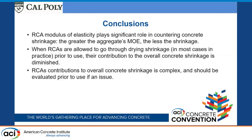Okay. My question is something I'm thinking. People think about recycled concrete aggregates. Sometimes they're porous. Saturated aggregates may be used as an internal curing agent. So that looks like controversial to the testing result you have. So I'm thinking maybe people should rethink about recycled concrete aggregates because they're different than the other porous aggregates because they have mortar. So this saturated water maybe can make the mortar hydrate a little bit more.